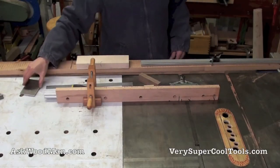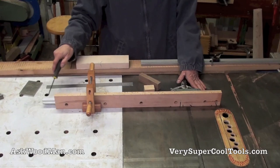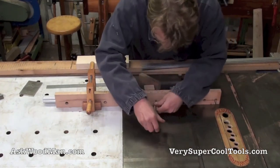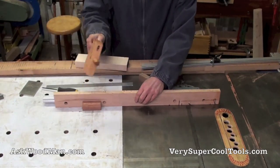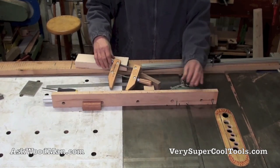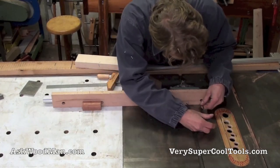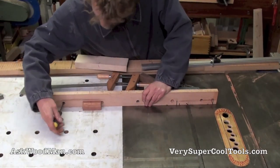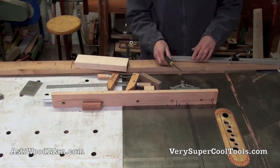Last year I posted a two-video series on upgrading my miter gauge by adding this aluminum extrusion as a stiffener and a way to shift my sacrificial board quickly, then re-lock it when establishing a new cut line. It's worked out fantastic — all I have to use is one ball driver to manipulate the whole system. I can loosen these and shift the extrusion if I need to.